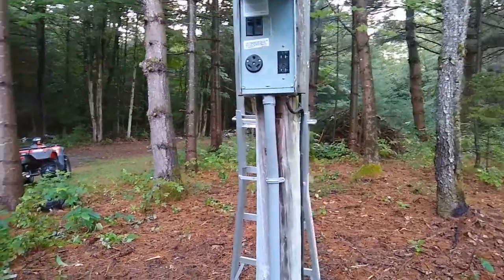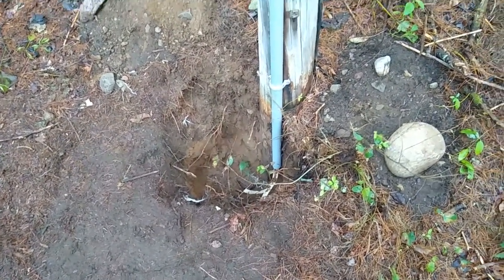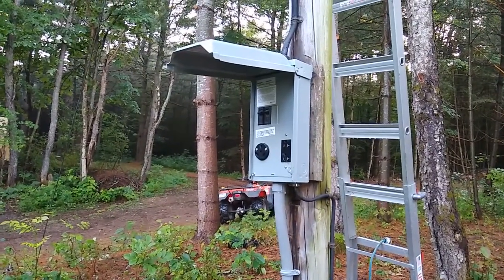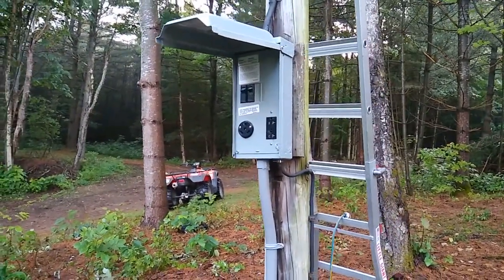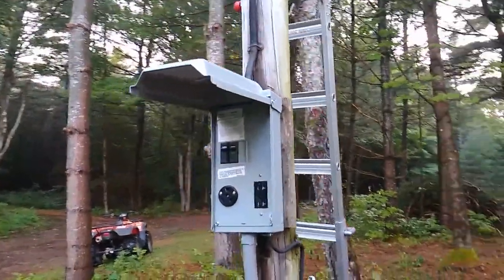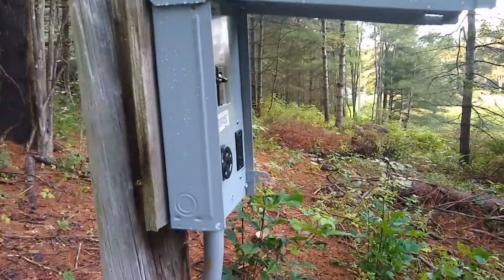Okay, I'm back next day. I got my PVC pipe run down into the ground. And I've got my 10 gauge jet pump wire up through and hooked up at the top, so I can run that. I'll run the other wire at a later date for my RV out on the point, when I put a 30 amp 3-prong 120 volt outlet out there, so that's for the future. But I got the cable all dressed up all the way up to the top and secured the old cable, and everything is good inside the box now. It's all closed up. I can run my pump with the generator and we're good to go for now.